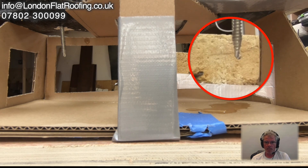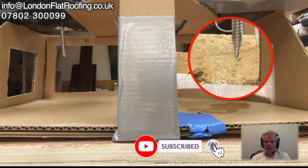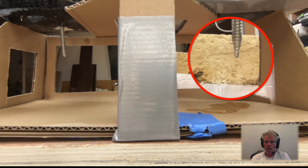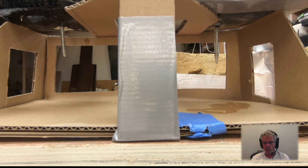Again, I don't think the screws are a great problem — it's the way the vapour barrier is fitted, especially around the sides, that's what I'm seeing fail. Don't forget to subscribe: I've got a couple of other videos coming out, one about the ply and another about wet insulation. Hopefully this has been helpful to you. My name's Steve from London Flat Roofing.